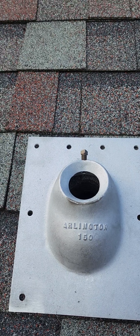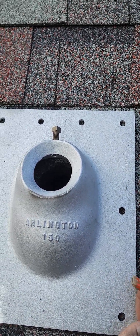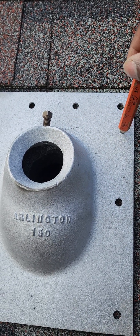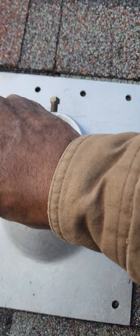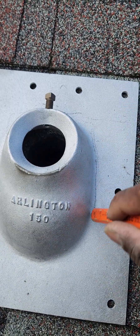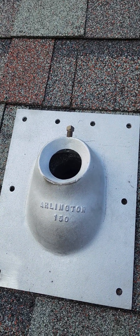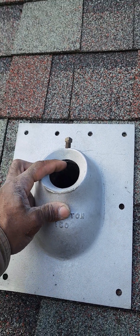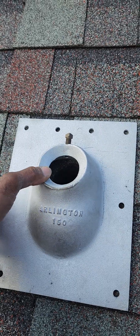Then you need to mark out a few sections. This is the area that you're cutting out of the roofing shingle. Then you're just going to slide that underneath — it basically replaces the shingle. You're replacing the section of shingle with the actual flashing or the roof plate.